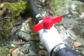Let's start at the top. Coming down the creek is a 200 foot section of 2 inch water line. At the end of that line I have a valve, and then after the valve I split up to a three inch line, which I immediately then knock down to four one inch lines. The lines follow a circular pattern around the bucket, and at the end of each one of those lines I go from a one inch down to a half an inch. So my final jet is just under half an inch, as I believe the half inch is the outer diameter of this piece here.